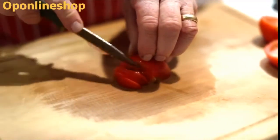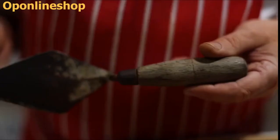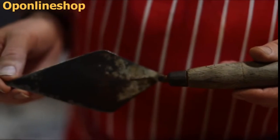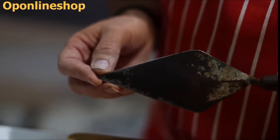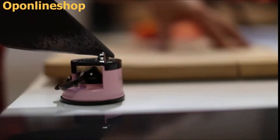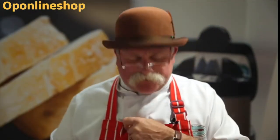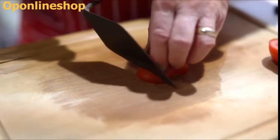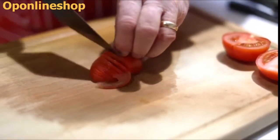The other type of carbon steel you get is drop forged carbon steel — this is incredibly hard. This is a pointing trowel made from drop forged carbon steel, and its regular job is to crack through bricks and rake out cement joints. I put a cutting edge on this from scratch and it took me 10 minutes, just to show you that no matter how blunt your existing knife is, no matter what steel it's made from, if you can do this to a trowel in 10 minutes, the bluntest kitchen knife you have will be razor sharp in just one or two minutes.